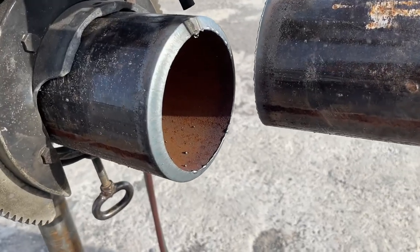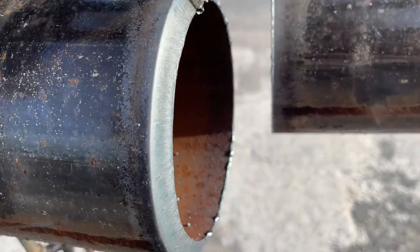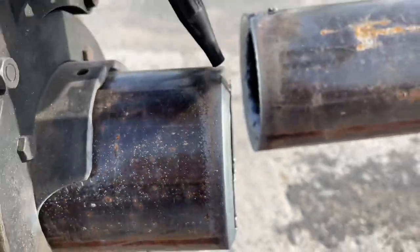Now that bevel is a little bit sharper than most — not bad. There's a welding inspector out there saying it's got to be 60 degrees or it's not good — forget about that. You cut it however you want to cut it, but just remember if you lay that bevel way back you're going to have to put a bigger land on it. The longer it is the thinner it is on the end; the sharper it is, the less land. Just a little tip, let's keep going.